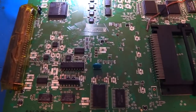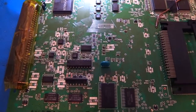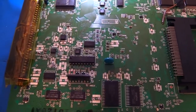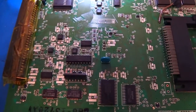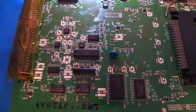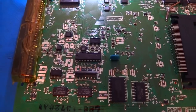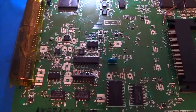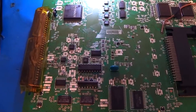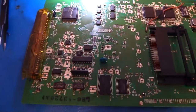So yeah, long story short, use SMD caps if you're good enough with a soldering iron. Through-hole caps are all right if you're not quite that savvy. Either way, it's fresh caps, so that's okay, but please stick to the electrolytics. Not a fan of the ceramics or tantalums until somebody convinces me otherwise. Like I said, it's what they used before, and the electrolytic caps that you can buy today are higher quality than what they shipped on these NEC boards years ago. Okay, so that's my quick rant about capacitors.